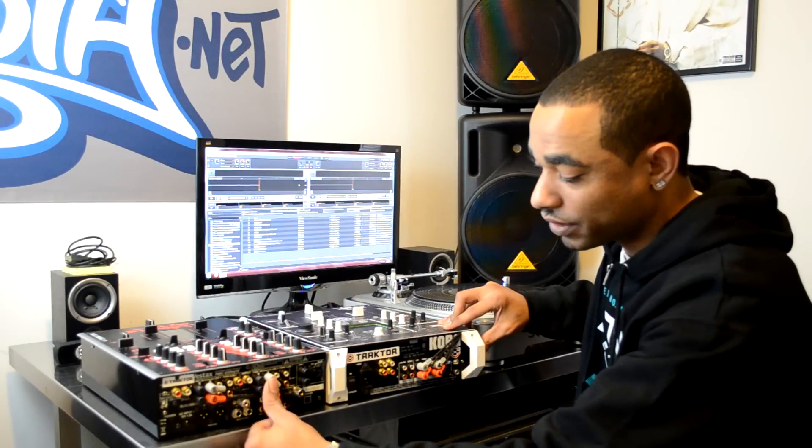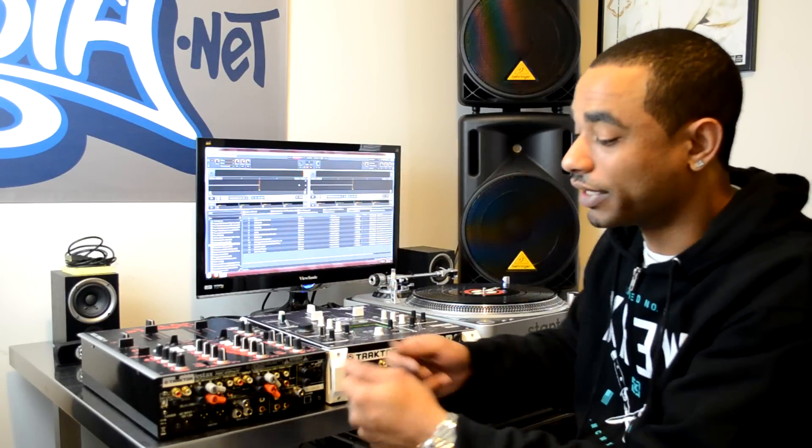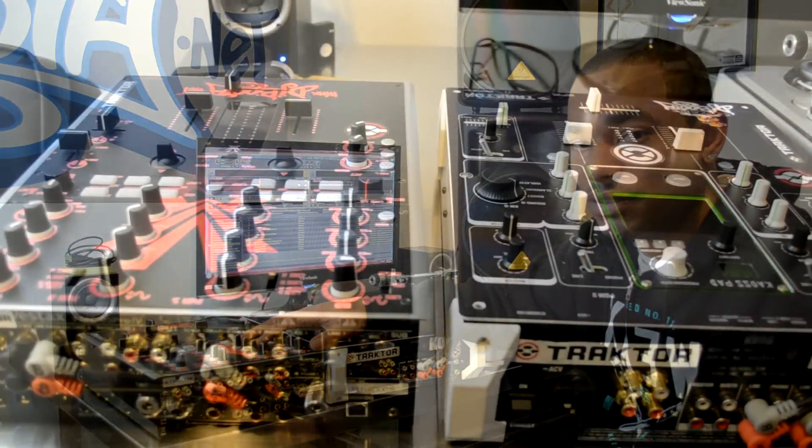I got some red and white RCA couplers where I was able to couple the RCA connection from the outside to the inside. On the inside of these mixers, there are RCA cables connected to those couplers that go to the inputs. For the outputs, I drilled a small hole to bring the RCA leads directly out and plug them into an input on the mixer. All you have to do now is plug in your USB dongle to power your audio sound card, then plug in your RCAs directly into your new Traktor inputs — first and second — and you're ready to go.